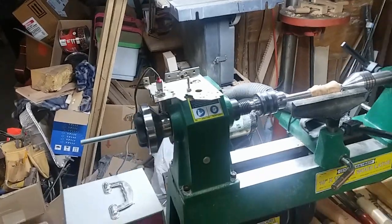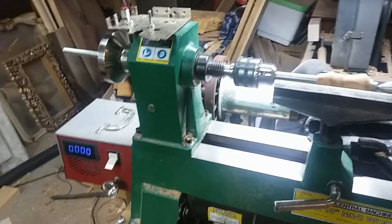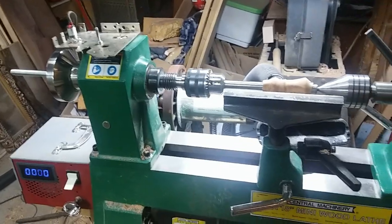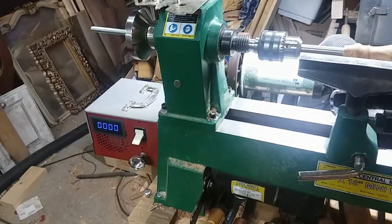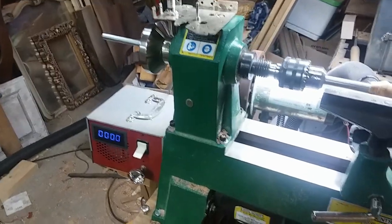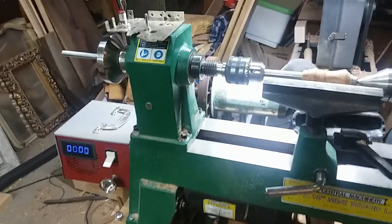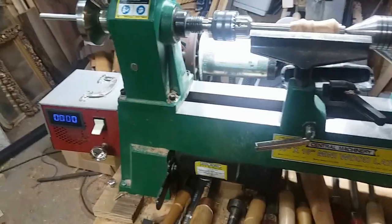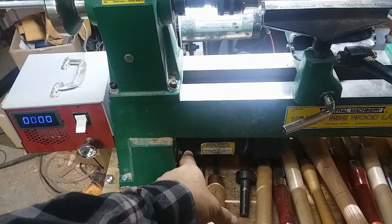This thing just works so slick — it makes turning wood projects so much faster and easier, not having to mess around with the belts. Just dial up the speed you want. If you're trying to turn a bowl and you're roughing it out and it's out of balance, you've got to start slow. That was one of the primary reasons I needed to do this — the slowest belt speed just wasn't slow enough for some of the bowls I was trying to rough out. Everything has to be bench-mounted; there was no way to fit that motor where the original motor went because of the flywheel.